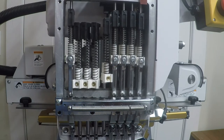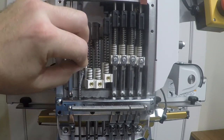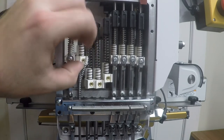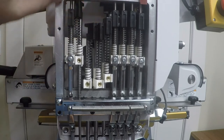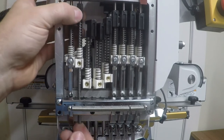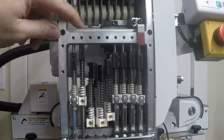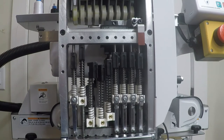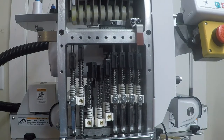For the needle bar guide shafts, push them up from the bottom. Put the bottom spring on first before it goes through the presser foot clamp. Come up to the top and you want it to sit nice and flush. Take your two-millimeter allen key and tighten that down, then repeat the procedure for the rest of them.